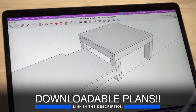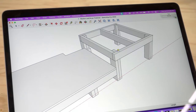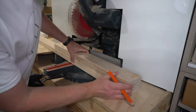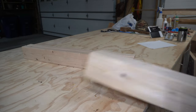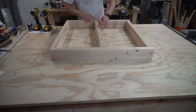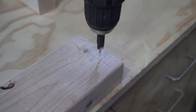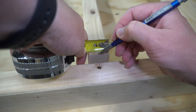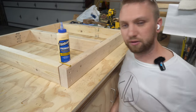I'm going to start with the easy side over here. If we take away this top piece, you can see we've just got some two-by-fours. This one is two and a half feet — I need two of those pieces. And this one is two foot three — I need three of those. I've got the holes pre-drilled. I'm going to throw in a little bit of glue in between those two pieces and then drive in some screws, and we should be good to go.